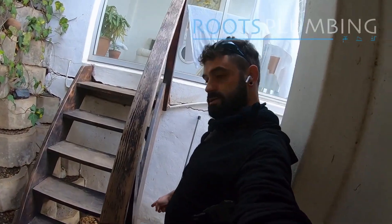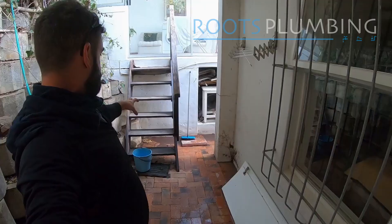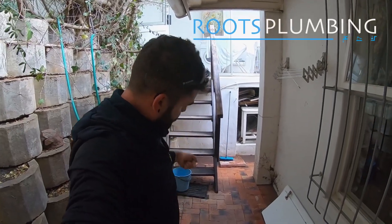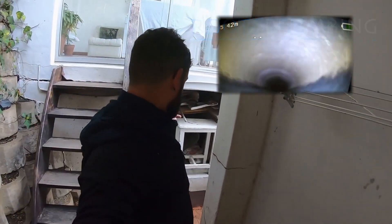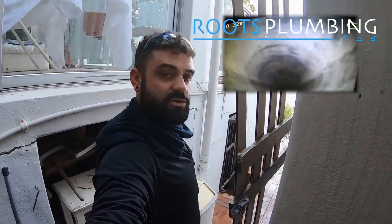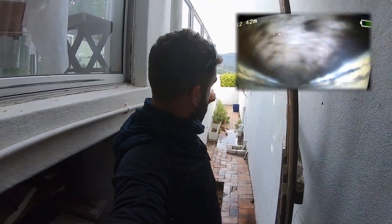The struggle today will start in this rodding eye. It goes into a junction and there are really thick roots growing into the mouth of that rodding eye and going that way and backwards. I followed the line around with the carbide teeth and just shaved all the excess muck off the sides of the pipe all the way along to the end of the drain.